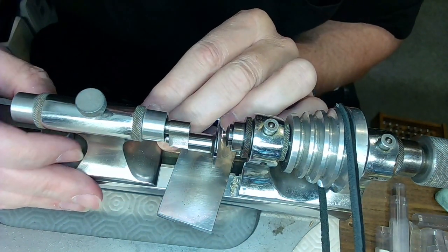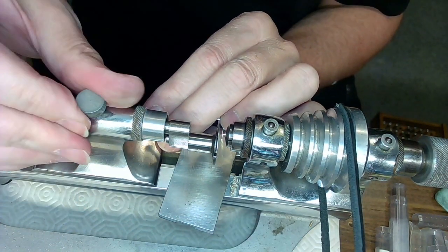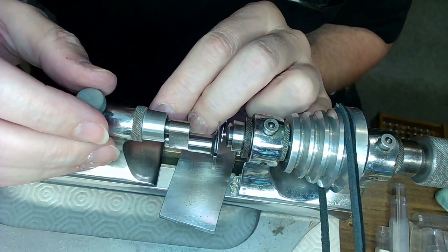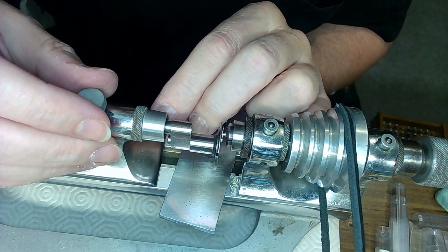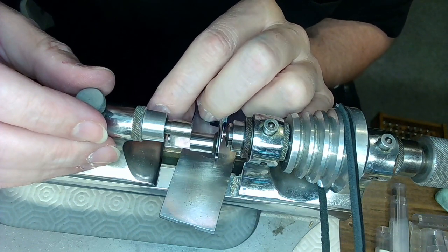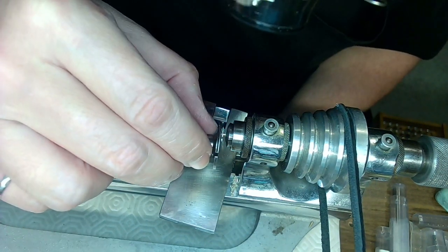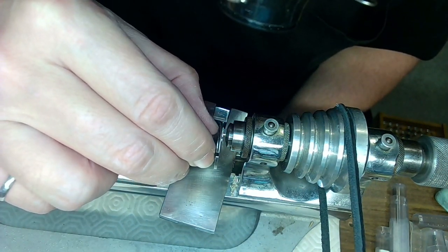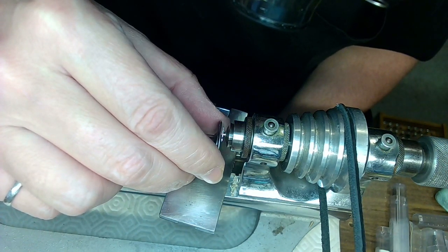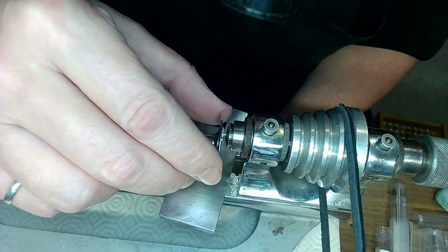And I gotta make sure my lathe bed is secure first and then tighten that, because I need to make sure it's close enough and it's dead center with that part. And it doesn't look dead center right now, so I may loosen that up a bit, or maybe it's just my perspective on this, because I don't know, that looks good there. Like that.